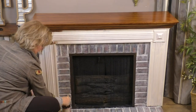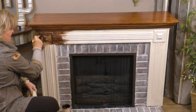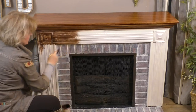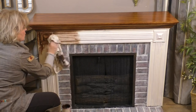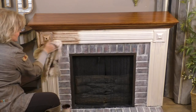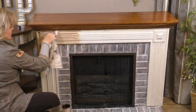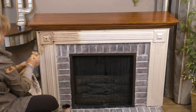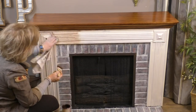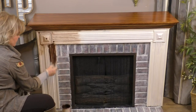Here goes the magic — I'm using the same walnut gel stain I just did on the mantel. I'm coming around and putting it on this fireplace surround so you can see how gorgeous it looks. If you saw me do my bench at home, this is going to give you that same look. Just pushing it right into those little cracks and ridges and filling them up, then taking the rag and rubbing it off. This adds that beautiful vintage tea-stain look to your white. You don't have to do this step — it's totally optional — but with all this detail, it needed a little something.